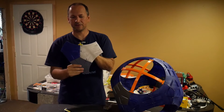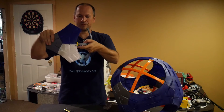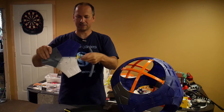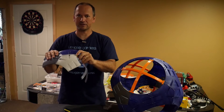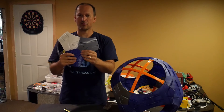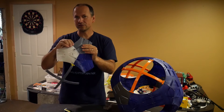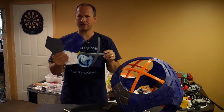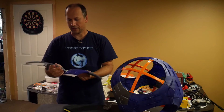There's an additional little piece required for the cross rib attachment that prints separately — these can be a bit of a challenge. They're recommended to print straight up and down, but I redesigned them slightly in 123D and printed them flat on the bed for a stronger print in terms of layer line orientation. It's more intense to put together because there's a lot more hardware involved, and because of all the joints it tends to slip until you get all the hardware in, then it starts to come together. No glue seems to be recommended, though I'm thinking some glue might help.